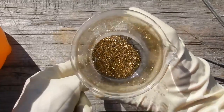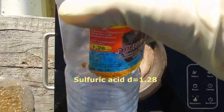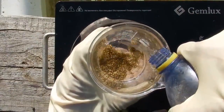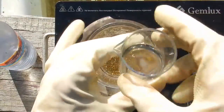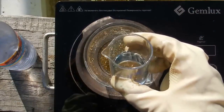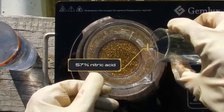We will etch the base from the contacts. I cover the washed contacts with dilute sulfuric acid — electrolyte with a density of 1.28. If your electrolyte density is higher, you need to dilute it with water. Set to heat, and gradually add nitric acid — 57% technical nitric acid — to release the gold. Density is 1.49.